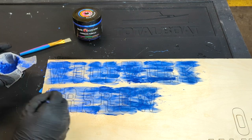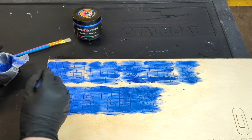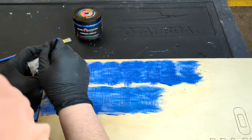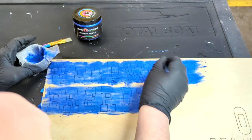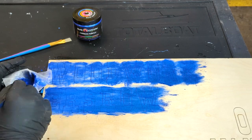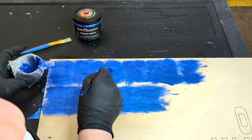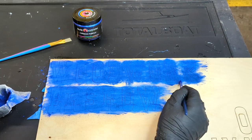You can use the affiliate links in the description below for the products I've been using in this project. Once I have completed the initial coat, I can go back and really work the pigment into the shellac and wood surface. I put my powder in a container lined with wax paper. You might need a little more to touch up areas that are thin, and you don't want to put this back in the original container — you can save any leftover for future projects. Let this dry for about one hour, and repeat the shellac and powder process again, only if necessary.